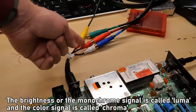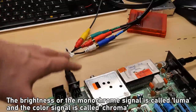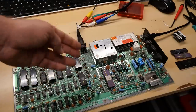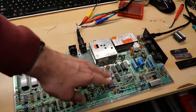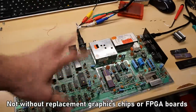The only way to really avoid those artifacts is to run the color signal to your monitor separately from the brightness information, and that way you get the clearest possible picture. Most other devices available at the time of the Commodore 64 had a native composite video signal. Take the Nintendo Entertainment System as an example — its video chip only outputs a single composite pin, so there's no way to get that clearer luma-chroma or S-Video output from that console.